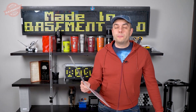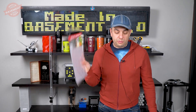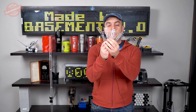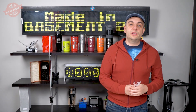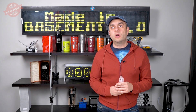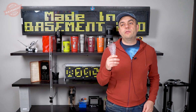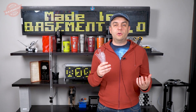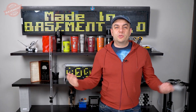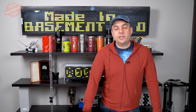This thing cuts great — or well, at least. When it's thin you don't get perfectly clean edges, but you don't need that for these. It's pretty easy to cut on the laser. I made a whole bunch here. My settings for my 60-watt laser were 60 millimeters per second at 50% power, which is pretty fast. The cut gives off a very light white smoke that looks almost like paper and doesn't really smell like anything. I don't feel the smell, but I don't know what's in it, so use it at your own risk. Let me show you how I did my flame test and how I laser cut these things.